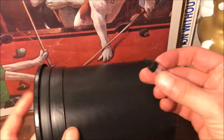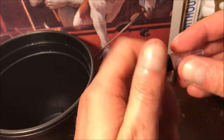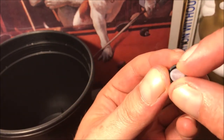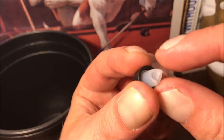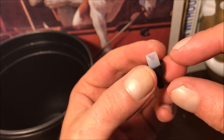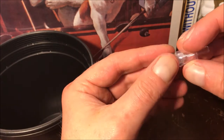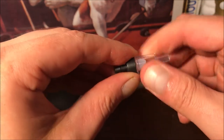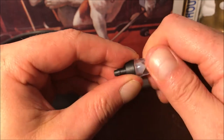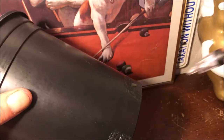For this particular one, I'm actually gonna use one of these one-way airflow valves. You can see it actually unscrews open here — it has this rubber septum which has a hole in the middle. If air or water is flowing this way it pushes on it and pushes itself closed, whereas if air is flowing from this direction it pushes it open. These aren't perfectly watertight or airtight, but if you put some teflon tape on the thread I'm sure you can make it airtight, or just glue it up.